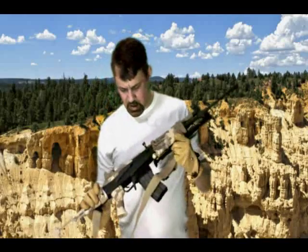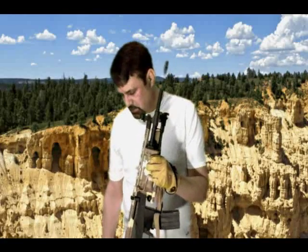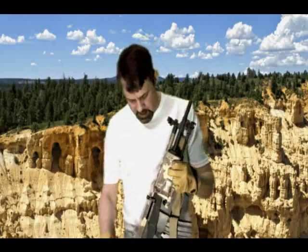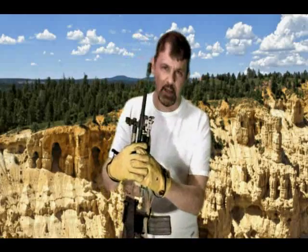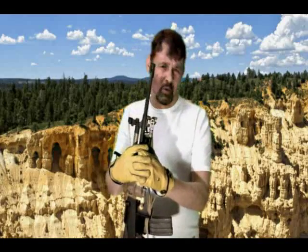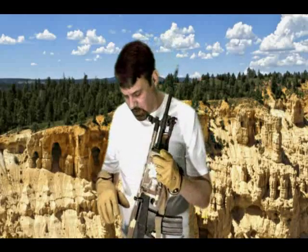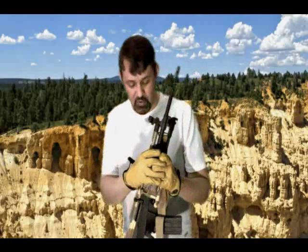This right here is a digi pattern. It was slightly time consuming — it didn't take too long, but it's not something you're going to rush out and do. I don't fire the Galil very often, but I wanted a nice durable finish. The black that you see is just standard black parkerizing. Once you put the Duracoat on there, it's extremely hard to get off. You spray it on and then you wait maybe an hour or two and you can handle the parts. At that point you could literally put it together and shoot it, but it's not recommended. Just let the rifle sit for two weeks, and during that timeframe the enamel will harden and get rock hard — you have a hard time getting this stuff off with a sandblaster.